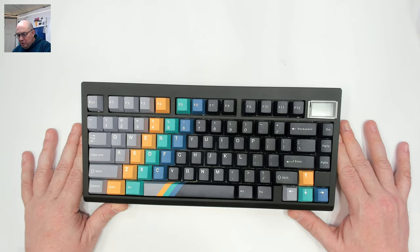So you want to make sure, of course, before going in, that your pins are perpendicular to the base of the switch. That way you're ensured that they're not going to already be trouble, not even line up. Again, lift up on the plate. You want to make sure that the center post is in there, so it should be in the right place. Nice, firm push down. Obviously, the plate's going to give a little bit, but as long as it locks into the plate, as you can see, we can only see the top of the top housing legs, but the bottom of the top housing is firmly flat on top of the plate.